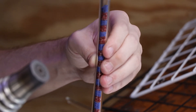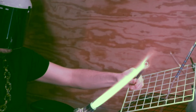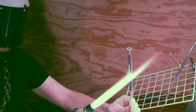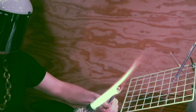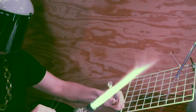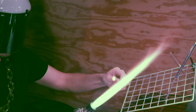You do want to take extra caution while working with frits, especially the finer frits. You don't want to breathe it in, and you definitely don't want to make it with a hammer — this is a joke. Ideally you want to heat up one end and get it completely molten to start pushing the air out of the frit and work your way all the way up the tube and completely melt the entire thing in. But today I'm working with a different technique, just kind of experimenting. Here I'm heating up the whole thing gradually to a nice working temperature before I close it up, but normally you want to work from one end to the other and melt it all the way through.